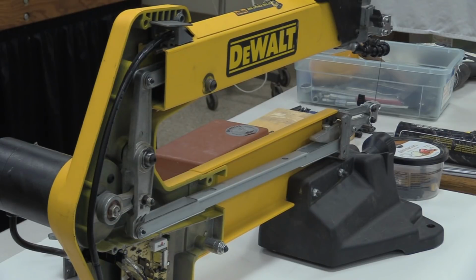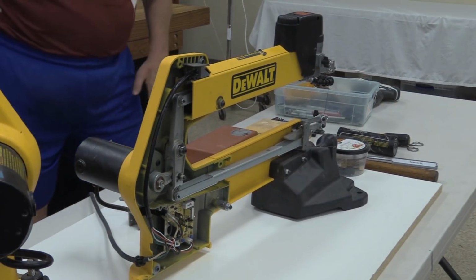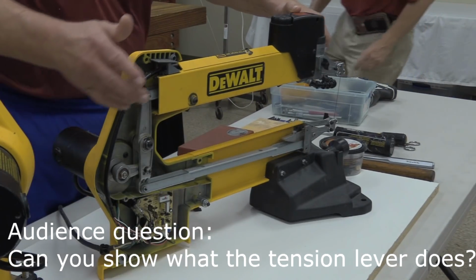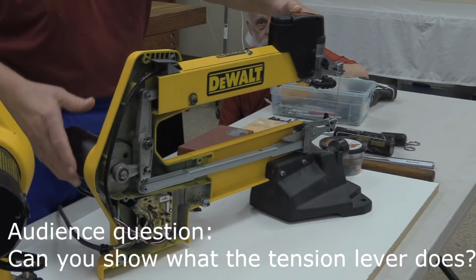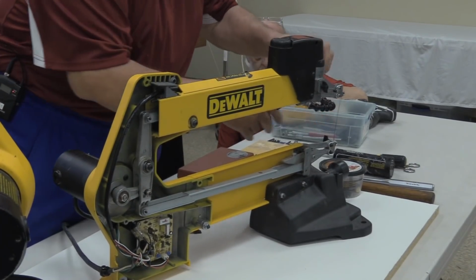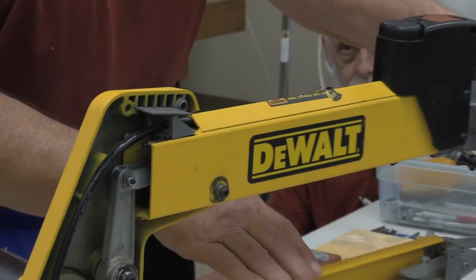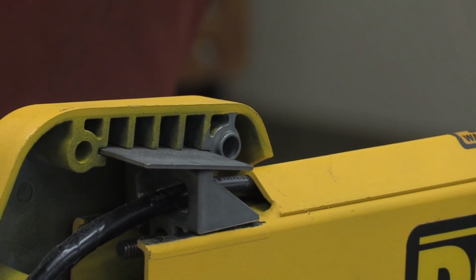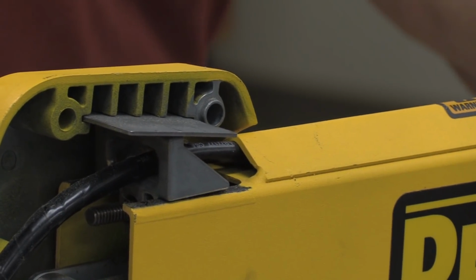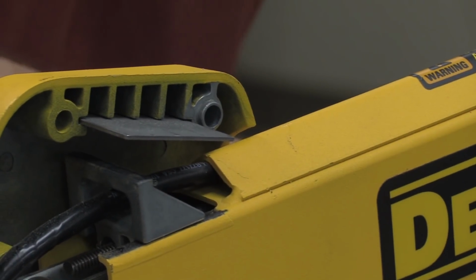In the number of times that I have done that, I've always demonstrated it with the table off without explaining to anybody what's involved in taking the table off. Actually, you're not going to see much happen other than to this wedge in the back here. Let me go ahead and loosen the blade here, it's more dramatic that way. When you operate the tensioner, you're pulling a wedge that's right there. All this tensioner does is it controls the arm height, so it makes the arm go up and down.